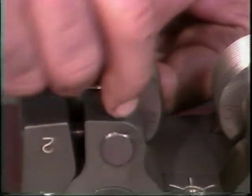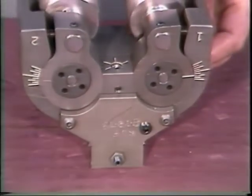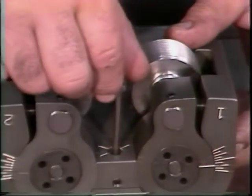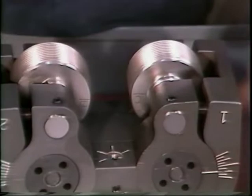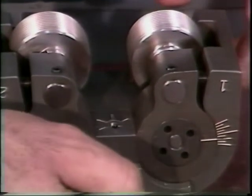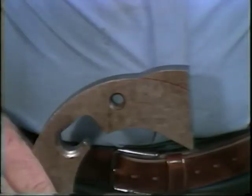Tighten the set screw against the flat surface of the roll pin. This completes the assembly of the head. Final matching of the rolls is done by loosening the locking screw and then rotating the micrometer matching screw. Hold one roll and push inward on the other roll during this adjustment. When properly adjusted, the match lines on the rolls will be in direct alignment with each other and on the center line of the rolls. After the adjustment is finished, tighten the locking screw. This completes the bench adjustment of the thread rolling attachment.